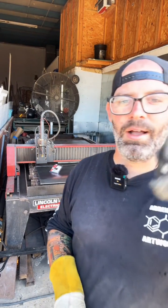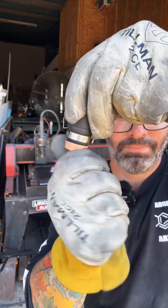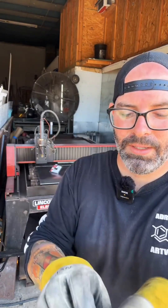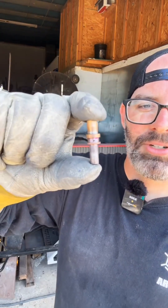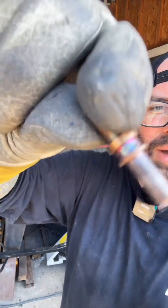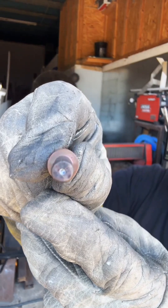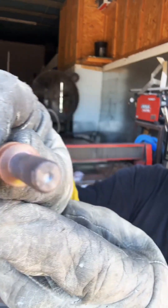The first thing on this head is you screw the cap on like that. There are a few pieces on the inside. This is your electrode — this is where the electricity actually comes out of. These things get worn down over time, and this little center hole right there is where the electricity comes from. Sometimes the arc will actually bore that out and kind of destroy the end of this.